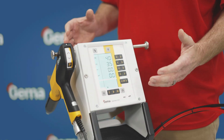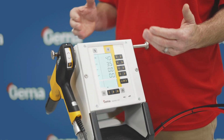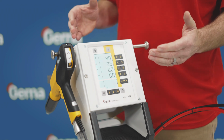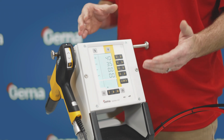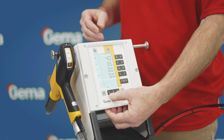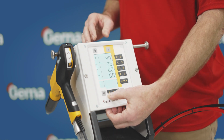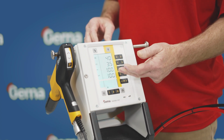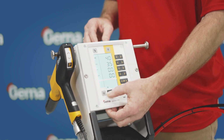One of the challenges of powder coating is being able to address and overcome Faraday cage effect and/or back ionization. For the OptiFlex Pro user, there are a number of different options available to you. Most people start with the flat parts or easy to coat mode, because we get full power, 100,000 volts and 100 microamps capability.